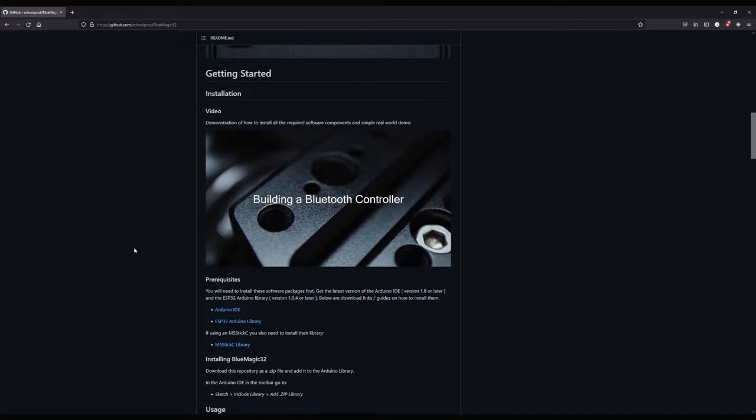But one thing that it did use was an ESP32 chip, which is this one. All right, similar form factor, in a way, bit bigger than the previous one, however. The ESP32 provided a lot more in-out pins, and it also had Bluetooth, Wi-Fi, and the microcontroller systems were much faster. It could run at a faster baud rate, clock speed, and overall it was a comparable, maybe even cheaper chip with more features and more functionality than the previous one. So at that point I thought, brilliant, let's try it out. And we'll get some of these. So I got quite a number, actually. I bought around 6 of these microcontrollers.